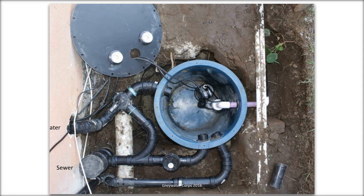The very bottom pipe on the slide is actually an auto flush, and I'll talk more about those. But that is a system that we often install that shoots in a few gallons of water every day, every 24 hours, and it cycles the pump and it cleans, it's fresh water. So it just cycles the pump and flushes out all the graywater lines. Moving on from there,